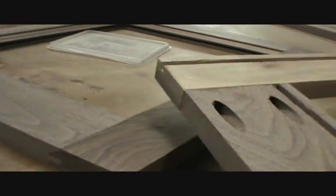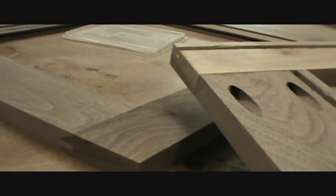Well, another guy I used to work with, he couldn't comprehend that, and he always wanted to cut all the parts for it all at once. I said, well, we sand that stuff. Even hand sanding plywood, you take a 32nd off, I'm going to get that wrong. If you take 2/32nds off, you took a 16th of an inch off, I think. Don't go by my math, but you took a 16th of an inch off, and that's not much, but when you've cut parts to fit with interference, that's a 16th inch gap. And then you start tweaking your cabinet, and yeah.